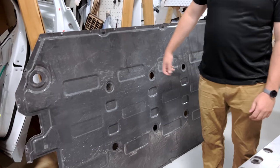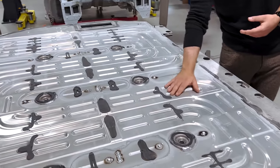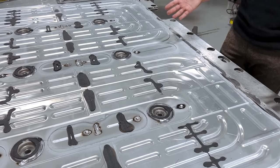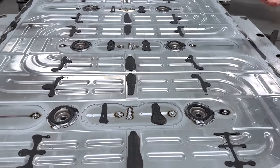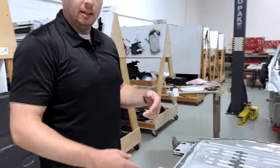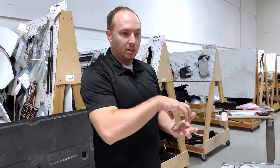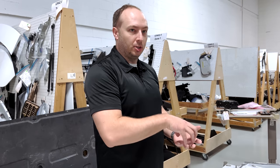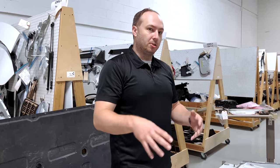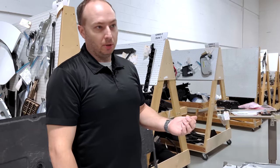The SMC cover provides an air gap between the channels through which the coolant is flowing, so some level of protection is needed — it's not as simple as just making the bottom of the pack the cold plate. Additionally, this design reduces the potential for an internal leak path. By having no connections from the cold plate to the modules individually, all your connections are external, so there's no chance of coolant leaking into your modules and batteries.